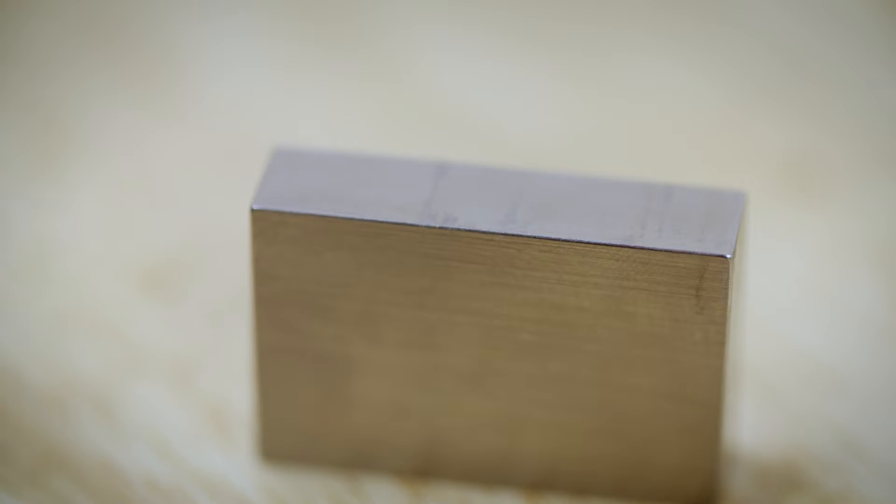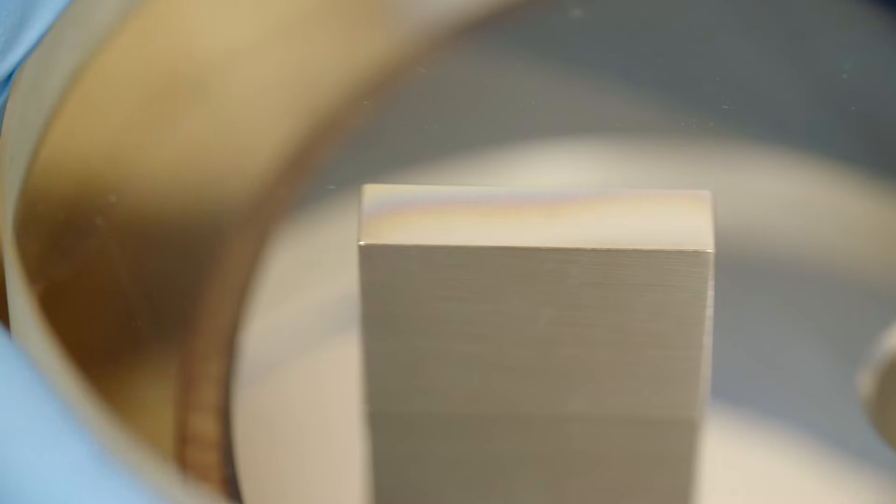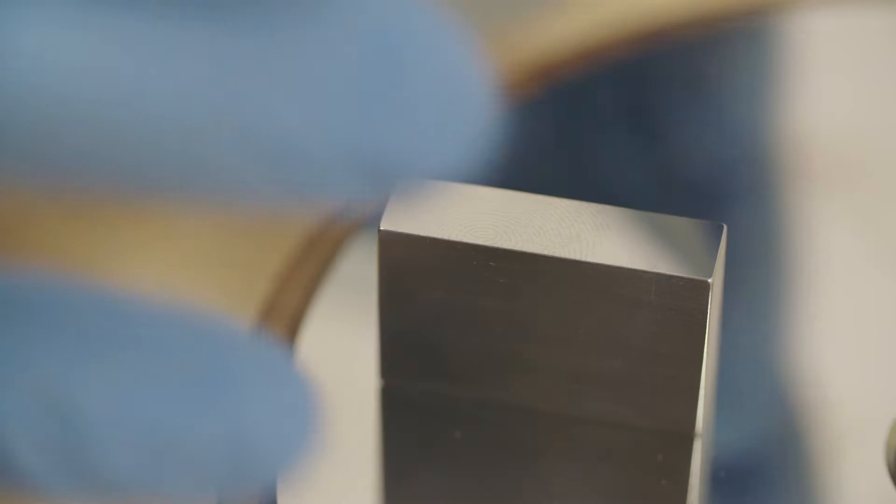The ringing film can be upset by having dirty surfaces, burred surfaces, or inconsistent film thickness of the oil that we use to ring the gauges together. When we have dirty gauging surfaces and we try to join them together, it can often feel like we have a good ring, and that's mostly due to the fact that we've usually got some sort of fingerprint oil on there which has a higher viscosity. So that can give you the false impression you've rung the gauges well together.